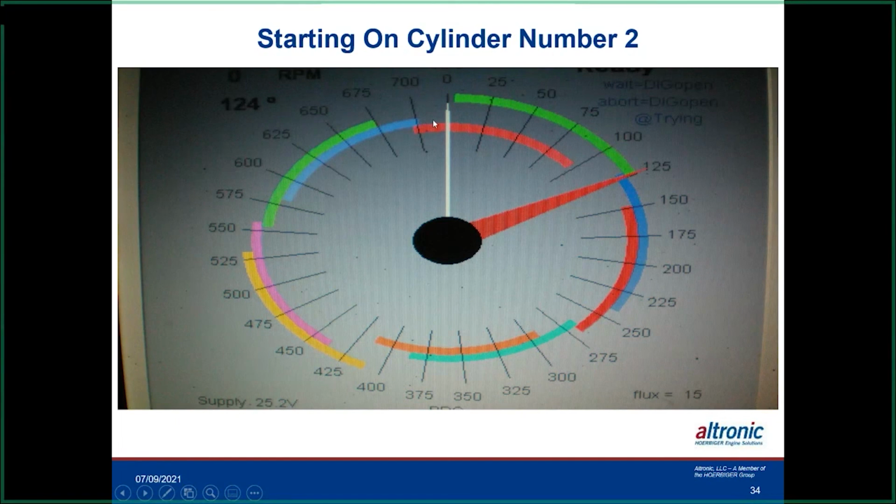Again, you need to know either when the exhaust port opens up or when the exhaust valve opens up, because you only have a certain period of time where you can actually push air into the cylinder without it leaking out of a valve someplace. So that's one important thing to know. If you're an engine analyzer guy or you have that kind of data, they can tell you when that valve is going to open up. That's how we set these up. Then after the engine starts rolling, we'll maybe back it off to, I don't know, 50 or 60 degrees, and only use this section here to keep the engine at a certain speed.